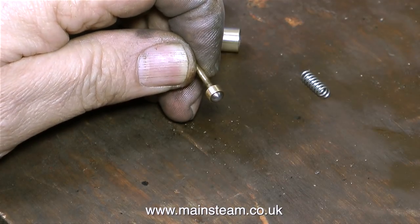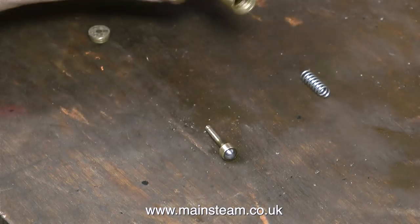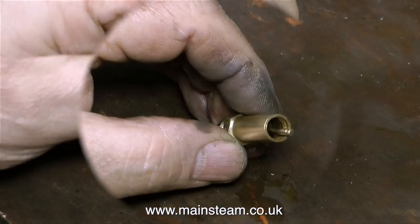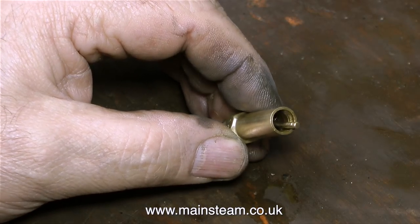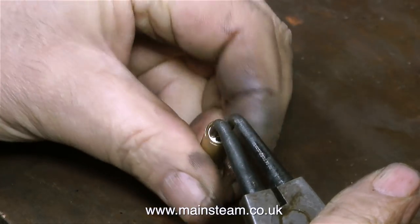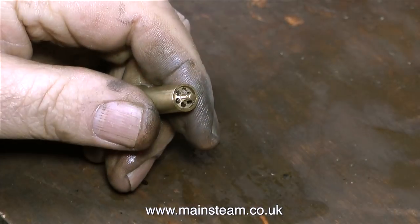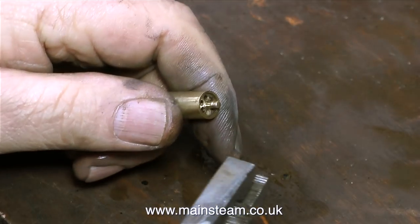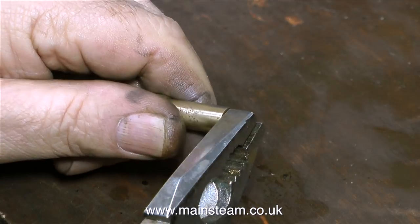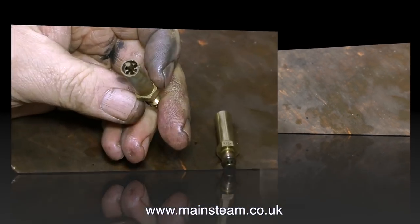Like a lot of the things on this engine, the safety valves are very well made, and this is an unusual arrangement — the ball is captive in the carrier. In this clip, I'm squirting some WD-40 down into the barrel of the safety valve and fitting a new stainless steel spring as I put the parts back inside the body of the valve. I'm using a pair of circlip pliers to tighten the spring tensioning ring, and then I always test it with a pair of pliers to make sure that I haven't tightened it too far and pushed the spring down onto the ball so hard that it can't move.